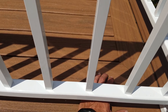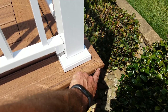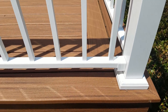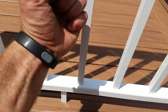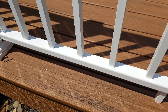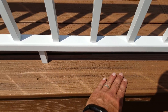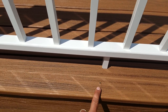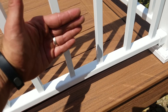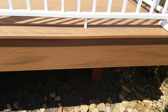On picture framing: when we first started putting these boards in, it started pushing out this gap. After talking to some people and looking at other decks, put a screw in right here and it'll hold that in place as you go, because once you start pulling you will move other boards if you pull too hard. Put screws about every 16 inches on this picture frame so that when you start putting boards in it won't drive that fascia board back.